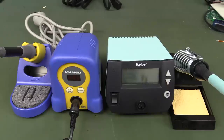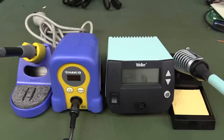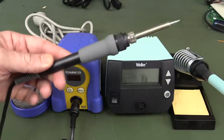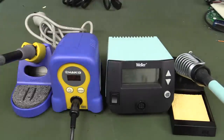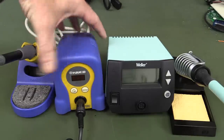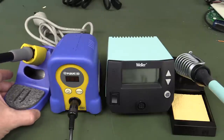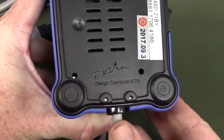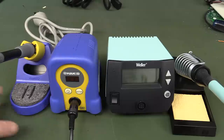I don't recommend anyone get a fixed-temperature soldering station if you're serious about electronics. At a minimum, I recommend the FX888-D — for around $110, you shouldn't be skimping on your soldering iron. I've done a video on a cheap $25 Hakko 936 ripoff and it's kind of meh. If you're really strapped for cash that's okay, but if you want the genuine deal, pony up $110-$120. The Hakko comes with a 65-watt iron and the Weller with a 70-watt iron — pretty much equivalent.